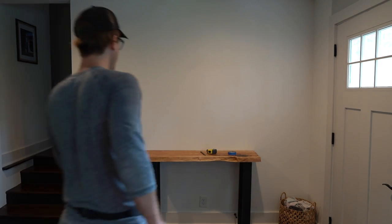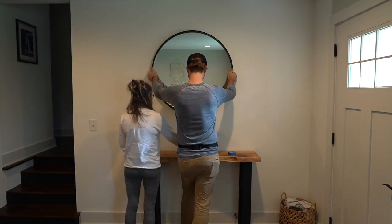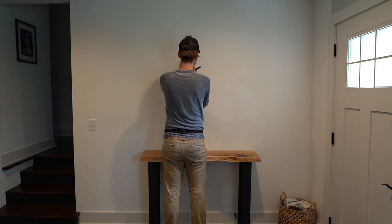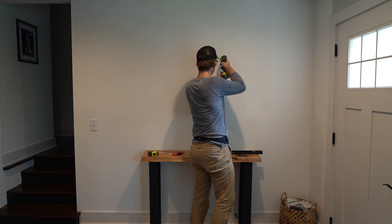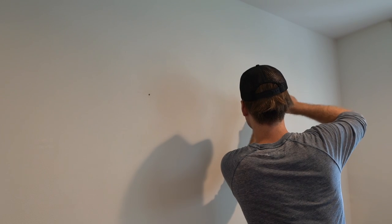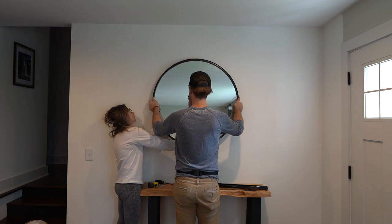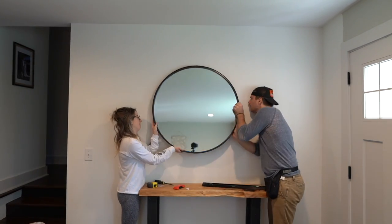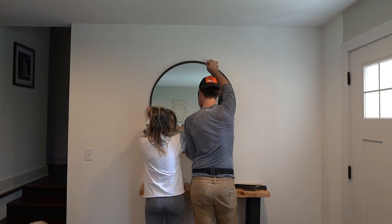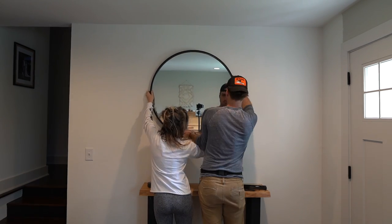Now it's time to put up our brand new mirror that we got at Target — I'll link it in the description below. If you're interested in learning how to attach a picture frame or mirror like this, check out our previous hallway project video. This mirror came with wall anchors and screws; the right side needed a wall anchor and the left side was right where a stud was, so no anchor needed there. This mirror was really frustrating — it took about 30 minutes to hang because unlike most picture frames, it didn't have the little metal pieces that flip out; it was completely flush against the back. I ended up using painters tape to line up the top of the face plate for where the screws would go, plus a vertical piece to align both sides, and eventually finagled it right where it needed to be.